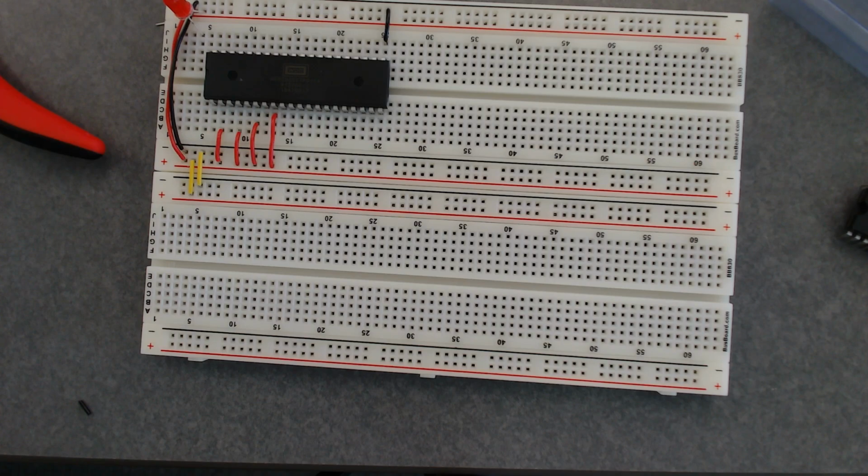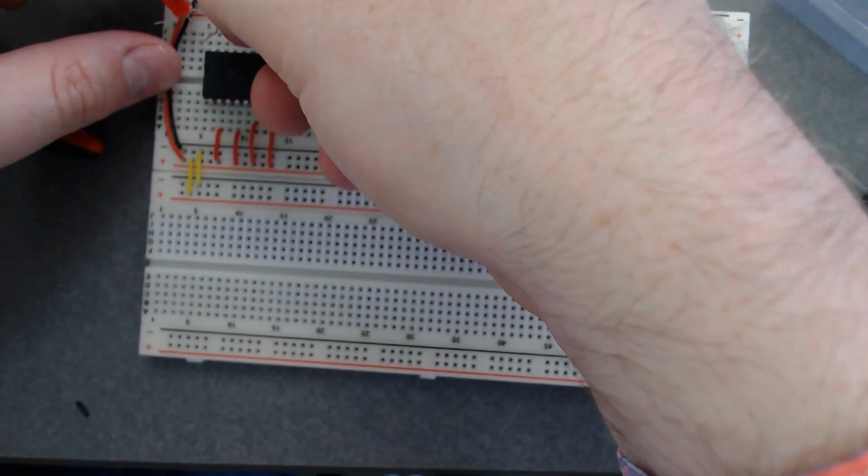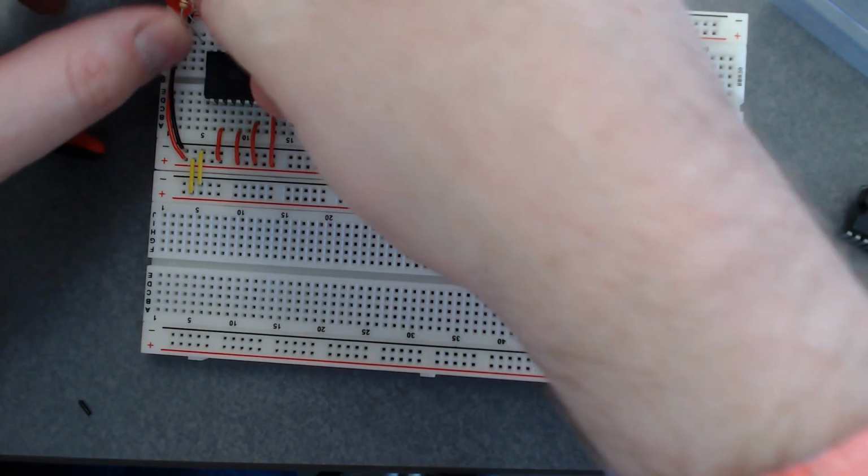So the way you read it is, you see red, red, brown, gold on the 220s. Red is 2, the second red is 2. This is the 4-band pattern, so the third band is a multiplier. So 2, 2 times brown, which is 10, is 220, right? Okay, 220 ohms. That is the resistance I need to go through an LED. Why do I need this resistor with the LED? So it doesn't get so bright and burn out.